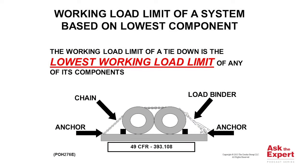Always remember that grade 80 and grade 100 chain do have higher strength properties than grade 70 transport chain. In addition, there are various connection points and products such as the Crosby load binder that are also incorporated into the tie-down system. All products and connection points will have specific working load limits. It is very important that when determining the working load limit of the complete tie-down system, the final working load limit is always based on the weakest component in the system, regardless of the grade of chain that is being used.